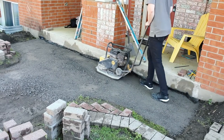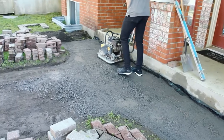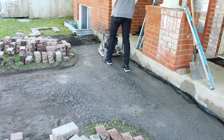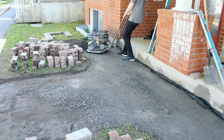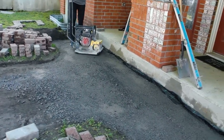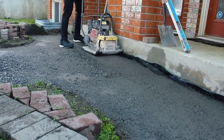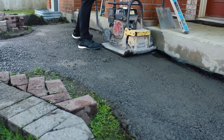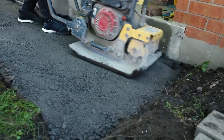This kind of tamper is a little bit big for this area. We have a smaller one we like to use for these smaller areas — a little easier to manage. There are also small reversible plate compactors that are good to use, where this one pulls itself forward, but when you want to pull it back you have to kind of lift and drag, and you might make divots in the grade you made. So different compactors might be better for different scenarios. This one worked for what we had to do.